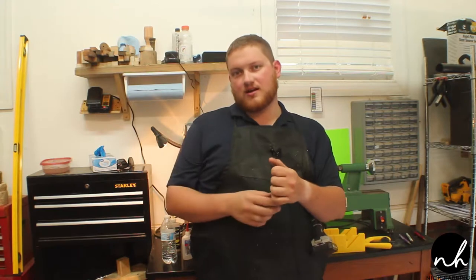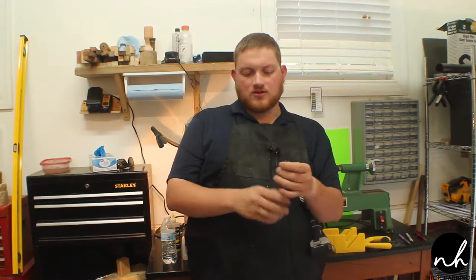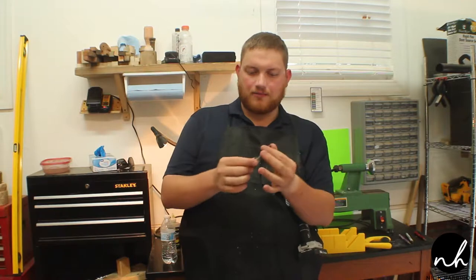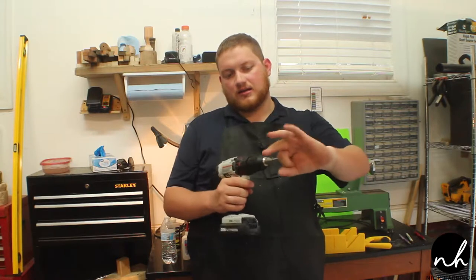You can use a pocket knife, but it's not very accurate. You can end up scraping the tubes in the wrong places. So you will need a barrel trimmer. The end of the barrel trimmer cleans the glue out of the inside of the brass tube. That's why it goes in the drill, securely fastens, put your blank on here, and clean the inside of the tube.